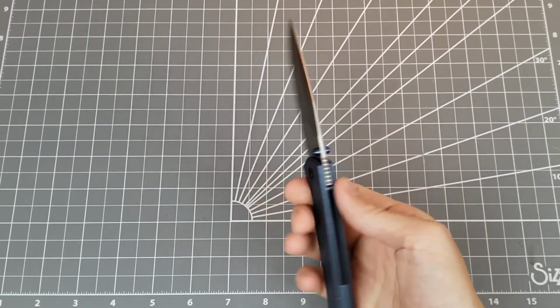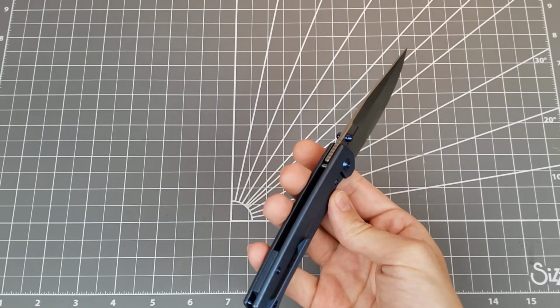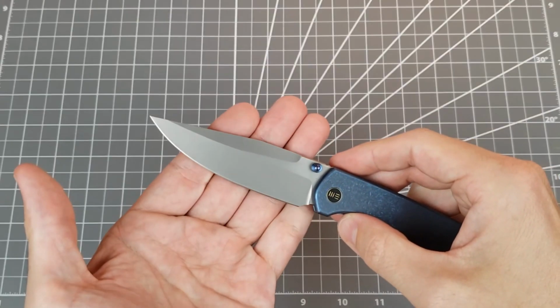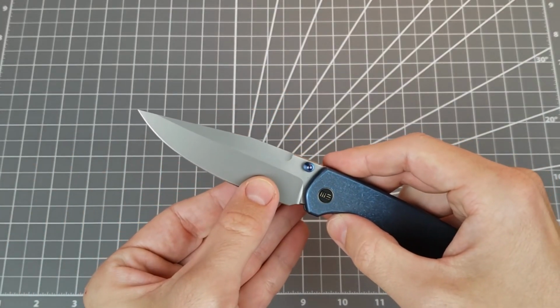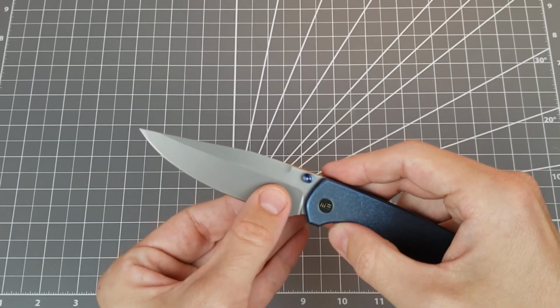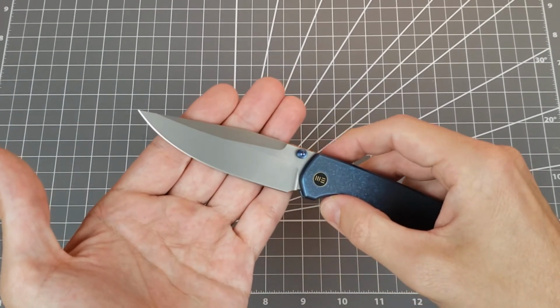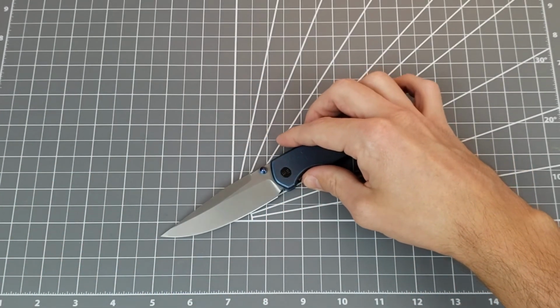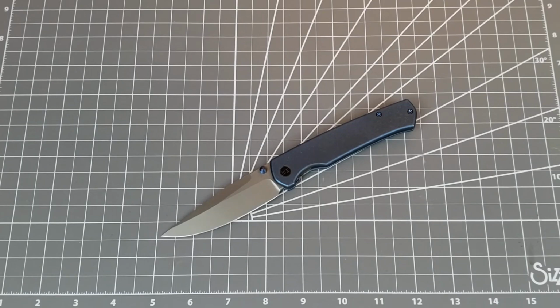And on this knife, I think I only have one neutral, and it's the blade grind. I wish that it was actually a hollow grind like it's advertised. If it is a hollow, it's incredibly minor. But I wish it was a nice, deep hollow grind. Maybe take this to like 10, 11 thousandths behind the edge. I think that would improve the knife a lot. I think this would be awesome with a good hollow grind.